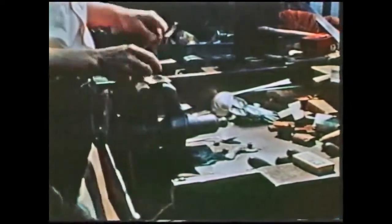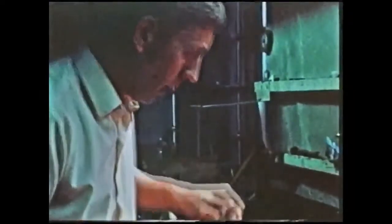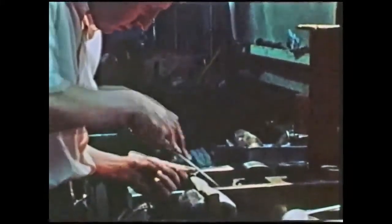We're striking off now to make sure the bowl is level. All the excess metal is then filed away, what we call in the trade struck off. That means that they file across the top of the bowl to make sure that it's nice and flat. The bowl itself is then straightened off. Holding it up and looking more or less across and down from the point towards the handle, you'll be able to see that across the bowl is reasonably flat, or should be.